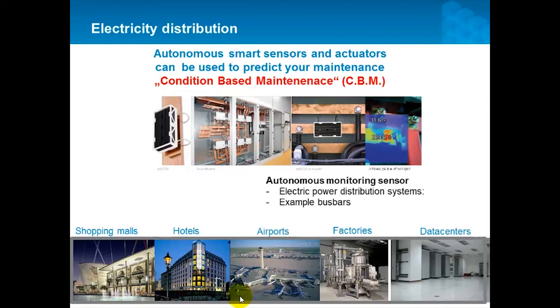Completely different: the heat source here are those. Every building, also this one, big building, big hotel, factories in semiconductors or automotive, any factory in the world will have kilometers of copper in the basement to transport the electrical energy to the machines, to the departments. I am sure that a plant like TSMC must have 30, 50 kilometers of copper, I promise you. And for the facility manager, there is a headache, which is something burns out, which happens. Those copper bars are connected every so many meters with a bolt. That's common globally. And the way of doing maintenance is with an infrared camera.